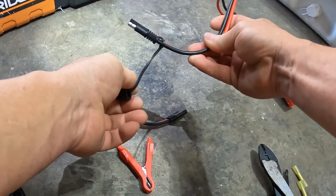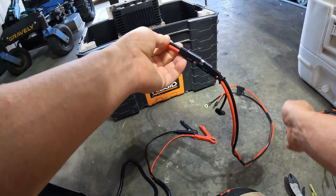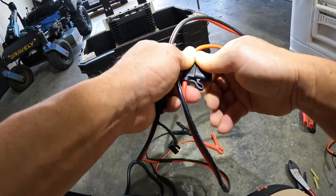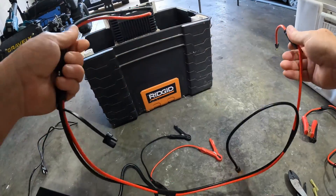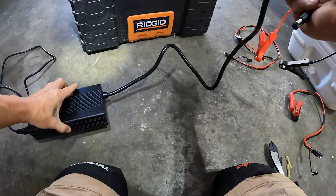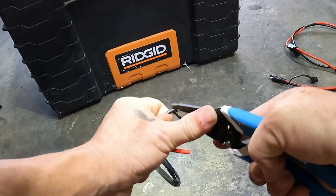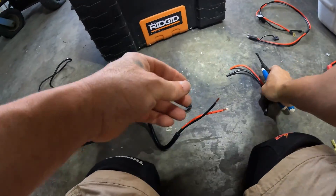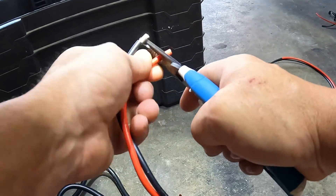We're just going to adapt the charger so I can go to this plug, or go straight into the battery. These ones line up red to red, black to black — that's going on the battery. I already changed this fuse, I upped it to 25 amps because this is a 20 amp charger, but if it blows I'll just jump it up to 30. This charger doesn't even have a fuse so it has some kind of built-in protection. It's a 20 amp, 14.6 volt. We're using 12 gauge here — this one might actually be 10 gauge. From the charger it's 12.